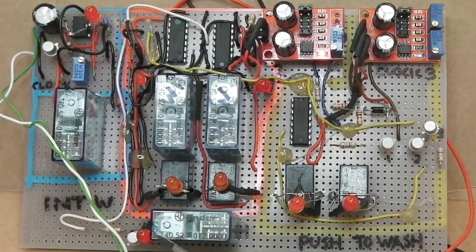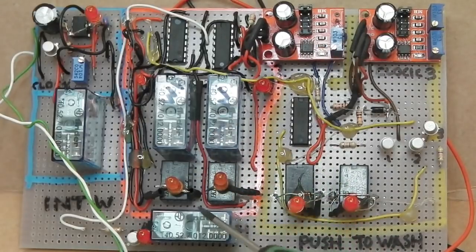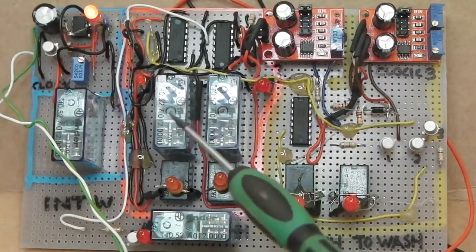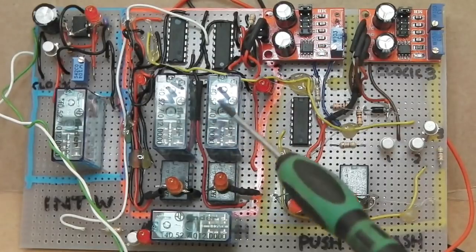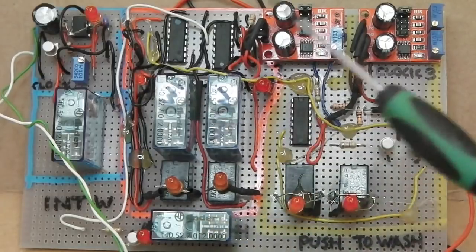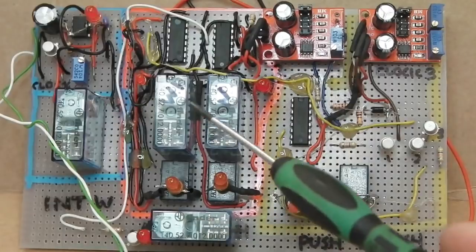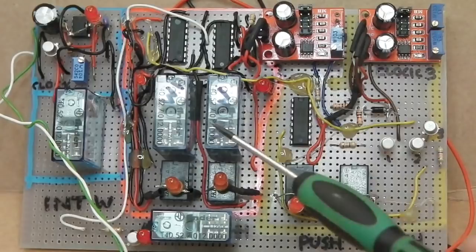All the time the automatic rain sensors have now become active and are looking for any pattern on the screen. And if indeed it finds that wash pattern flags up as rain, it'll actually wipe as well as this automatic wipe relay here. So this will wipe anyway, regardless of what the rain sensor's doing. But if the rain sensor also agrees and thinks, yeah, that looks like rain droplets, even though it's the washer jet, it will come on in tandem with this. In fact, it might even come on between the circuits.